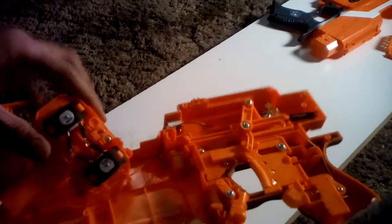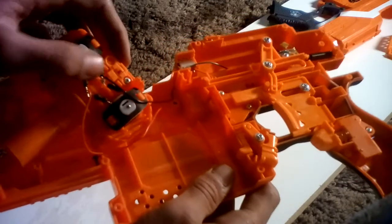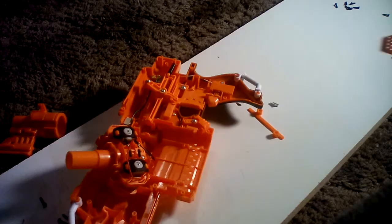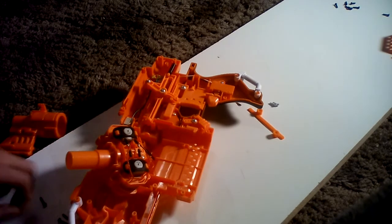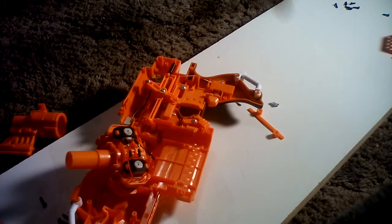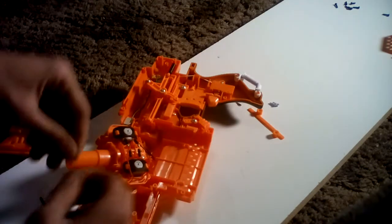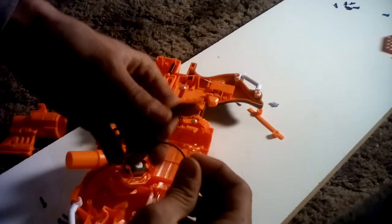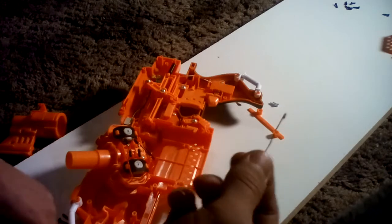So on to the actual engine improvement. You're going to want to cut off these 2 black things and replace them with copper wire, and I will show you how to do that in just a second. Before I do anything with these resistors, I would first get some electrical wiring. I got mine off of a little power plug-in. Get a razor, or a stripper if you have one, and strip the wiring to where it's only copper wire.